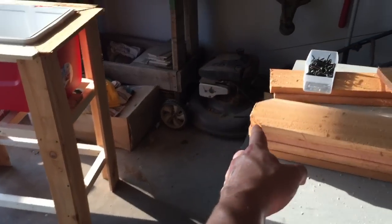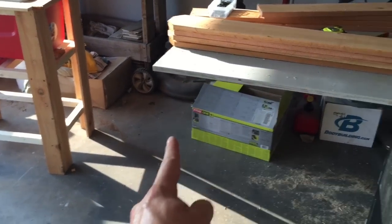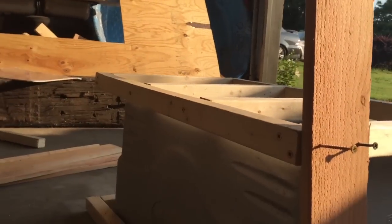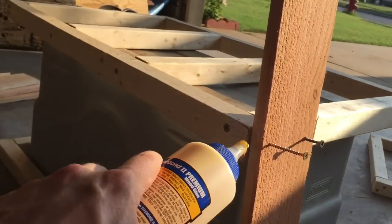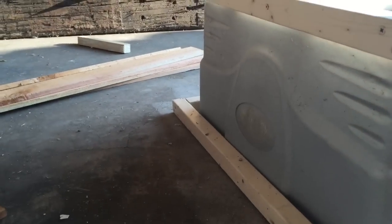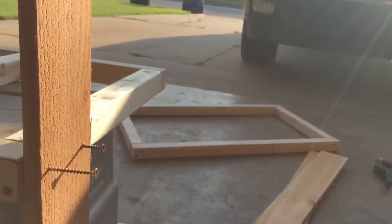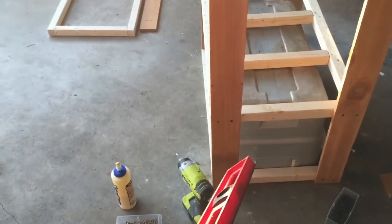Once it's level, I'll start screwing. If you use this fence post like me — 72 inches long — it takes up a little over an inch. Cut the top parts off with the miter saw, then cut them in half and you're looking at about 35 to 35.5 inches. I stack them on top of each other, make sure they're straight and level, and cut at 35. I pre-drill all the holes to make it easier, use wood glue, and ensure everything is level and butts up perfectly — not overlapping, not going too far under.